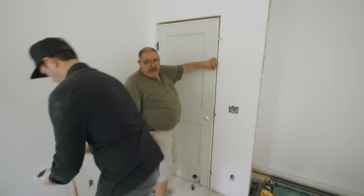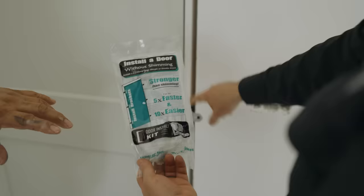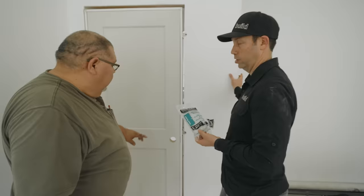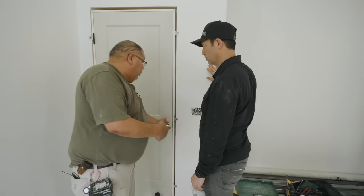There's also a door install kit — essentially metal brackets you fasten first to the door, then screw into the framing on the door jambs. It even comes with screws sized so they won't go through your jamb. The kit also includes pieces that tie to the two-by-four framing to hold the door plate in place until you trim it out. It's a great system.